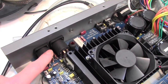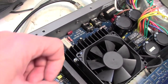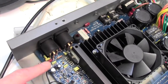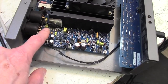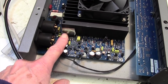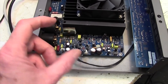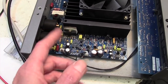They come out on these 4-pin Speakon connectors. Normally a Speakon connector is just 2-pin, it's just a fancy loudspeaker connection, but these 4-pin ones can be used to give you two outputs, one for the subs and one for the tweeters, and I don't know what pins there are on there. It's not going to be easy for me to test that, so if I do get involved in replacing that, he's going to have to bring the cab over and we're going to have to hook it up to the cab and see what's wrong there. I don't think there'll be anything wrong with this cab because these sort of things are always short circuit protected. You can't just short the output and blow the chip up. They're pretty good, these type of things. So why that's failed, we don't know.